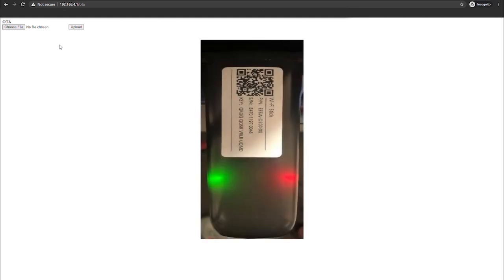To track how it is going, you're going to want to look at your dongle. When the red light on the dongle is the only one shining, the process is done for uploading your OTA file. The dongle will restart afterwards and start flashing a green light, and then you will see a solid green light appear once the process is fully completed. This can take upwards of 5 minutes or so.